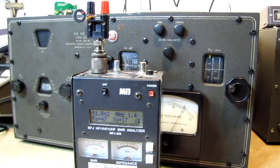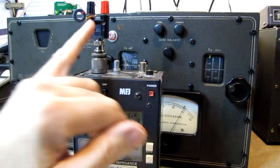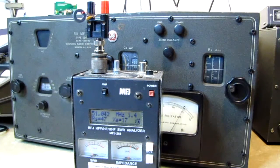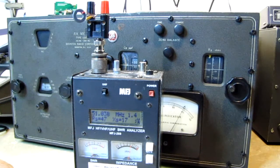There are going to be minor variations because there's capacitance just in this connector, the length of this connector, how far away I was from the top of this bridge — all of these affect how much capacitance was in parallel. But the difference between 47 ohms here and 51 ohms there is really insignificant; that's very, very close. We could drop that into our circuit and have it work just fine. The VSWR difference would be almost unmeasurable without some really fancy laboratory equipment. In real life, this capacitor would typically be a variable trimmer so you could dial out any incorrect reactance.